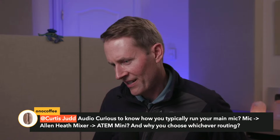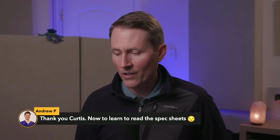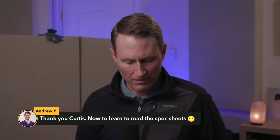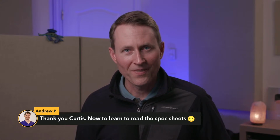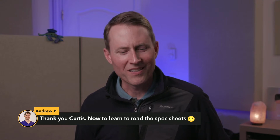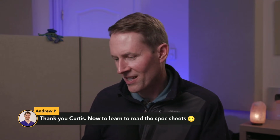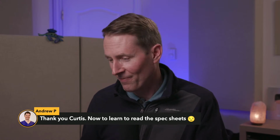All right, just to follow up with Andrew. Thank you, Curtis. Now to learn to read the spec sheets. I'll go take a look at that, Andrew, and see what I can find out. I have seen mistakes in spec sheets before. Minus 10 dBu doesn't sound right to me. Normally it's a minus 10 dBV, but I'll take a look at that when I get a second here, and I'll get back to you on that.